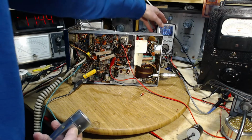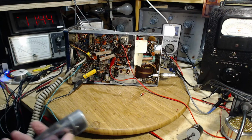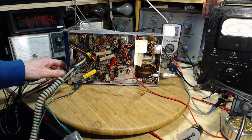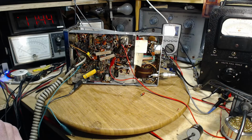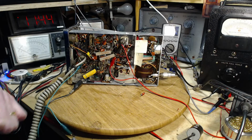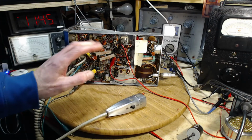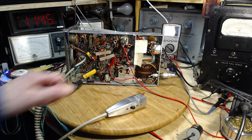Okay, so we should see under 2 volts here, but above 1.3. Should anything else happen? Volume down. I don't think so. You should hear a nice click on the relay. This is all about testing the relay, really. I saw 2 up here. Interesting. Okay, so I think that indicates everything's okay, and I can continue with the checking of the last big green guy.